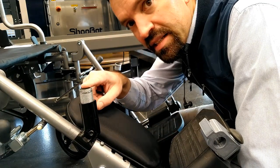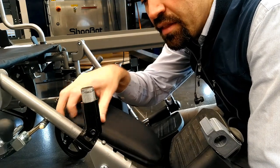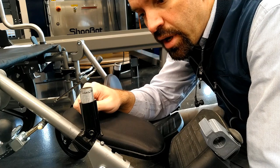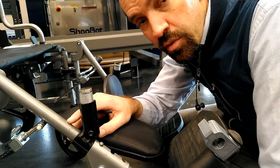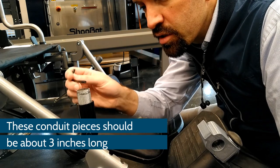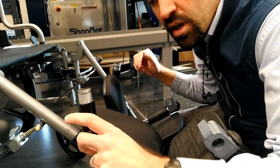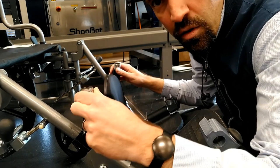The next thing you need to make is the base that the structure fits into. This is simply a short piece of EMT conduit that goes into one of the Maker Pipe connectors — the 45-degree connector — and it clamps directly onto the footrest of the wheelchair itself. Take a scrap of your connector, pop it in there, and tighten it down. You want it nice and secure so that this part doesn't slide out of the Maker Pipe.